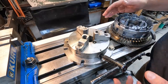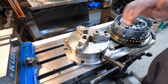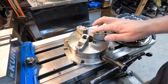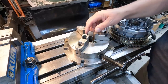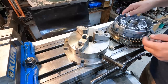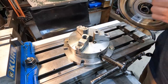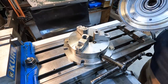So this is the three-jaw chuck that I was talking about earlier that we're going to use to hold this. This is a low-profile chuck designed to be mounted down to any kind of machine table where you can utilize a self-centering chuck to hold something either vertically or when it's a little more difficult to pull it down to the table using strap clamps. We've already got it bolted in nice and rigid. And there's the hub that we're going to be chucking on right there.